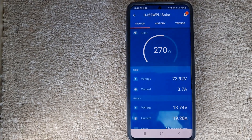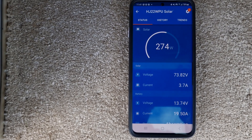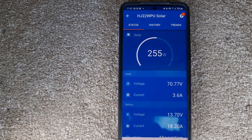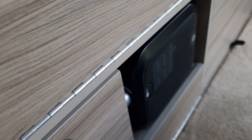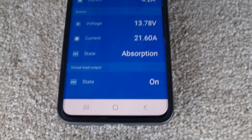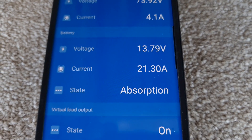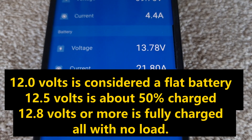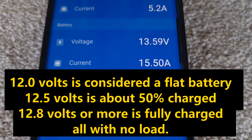That's quite impressive. Five minutes ago we had a fully charged battery and the solar was hardly putting anything in. Now we have a load — the inverter running the fan heater, which you can probably hear — that's 1,500 watts. It's worth pointing out that the voltage here doesn't really give us a reliable indication of the state of charge, because we're in the sun, so that's an artificially higher voltage from what's going in to charge it.